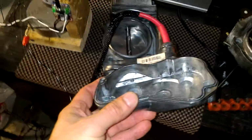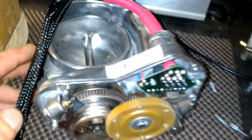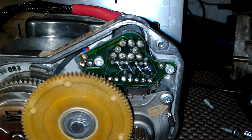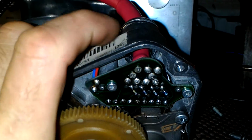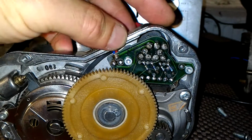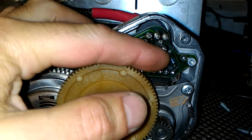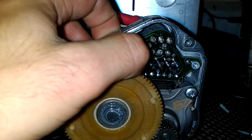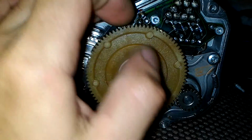So as you can see, I cleaned up the case. Okay, in here the board was resoldered and cleaned one more time. There we go. So the water was coming out from the original piece of aluminum that I usually leave, and it was accumulating on the board, and then it basically started to connect these terminals, and these are sensitive because the chemical process and corrosion started, and it was spreading between terminals.